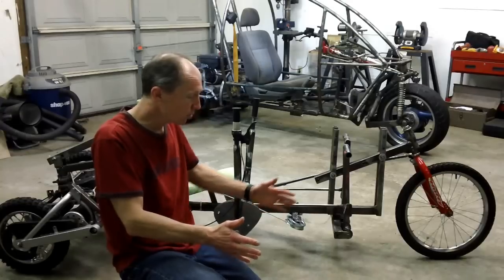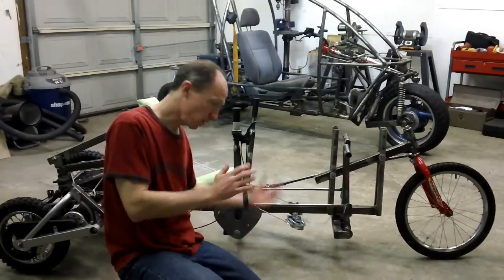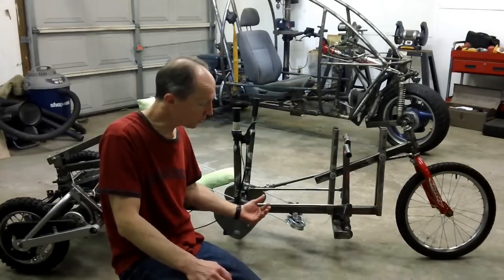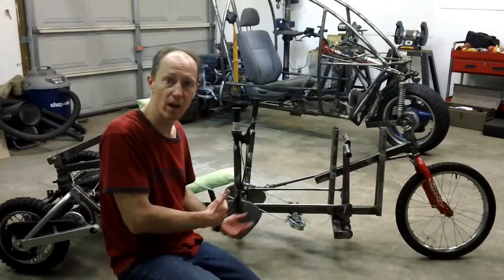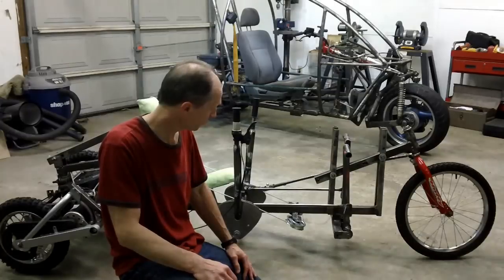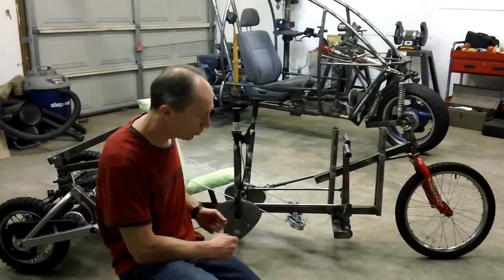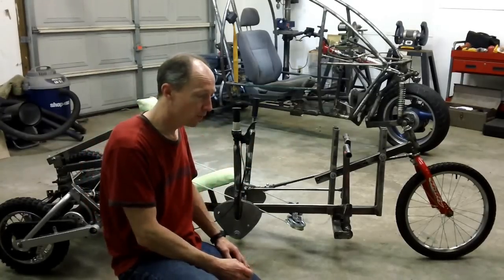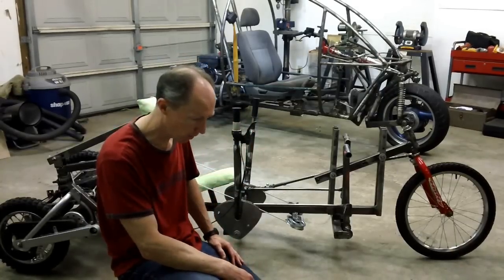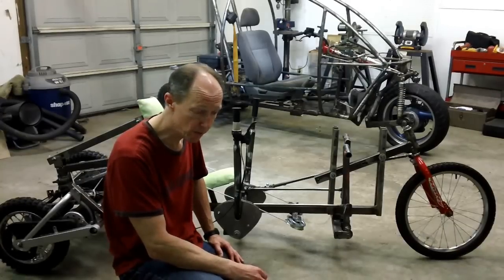If you try to turn the wheel before you start tilting, the vehicle starts falling to the opposite direction. And so then the hydraulics have to really kick in gear and use a huge amount of force to get the vehicle to tilt. This is what they were fighting over here with the Clever. And if you do a real sharp turn, the forces are so severe that the vehicle was trying to flip, like I showed you in that picture right there. Never did figure out how to fix that.